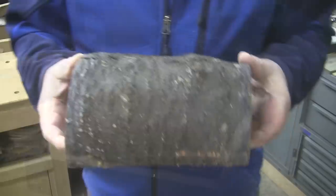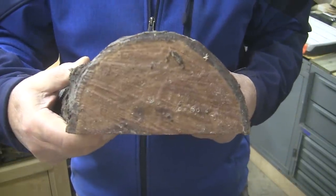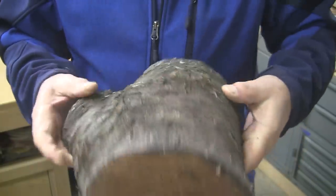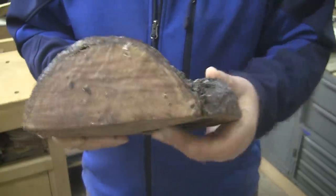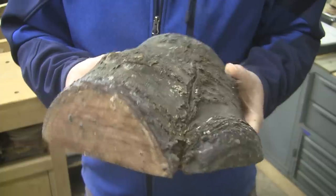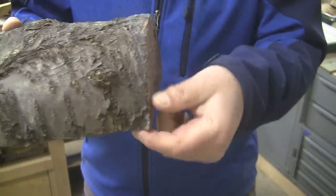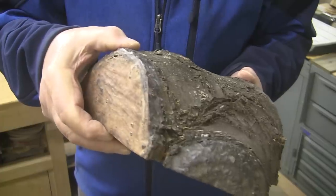Let's take a closer look at it. The piece is about eight inches long, about seven inches wide, and if you include this part it's about nine inches wide. It's four inches tall on that end and three inches on this end. Now the bottom is not cut flat and that's what accounts for that difference in height. So when I drill for my woodworm screw I'll shim this up so that when I work on the bottom I'll turn away the thick part down here, which should bring it closer to the thickness of this end.